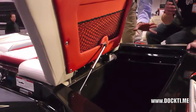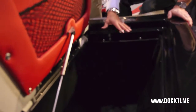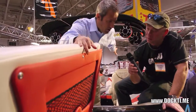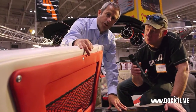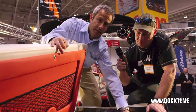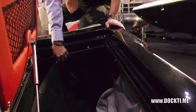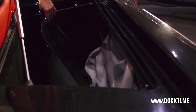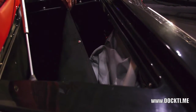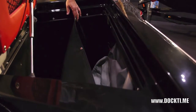Here we have 900 pounds of ballast fixed in hard tanks between the two sides and the bow. This one is equipped with the surf wake option — the 1,600 pound version. There is a piggyback system that as it starts to inflate, knocks its way down and out. The piggyback system fills up and now you've got all of your weight in the boat without a fixed tank taking up all your space. When you empty it all out, it goes back in behind. Smart.